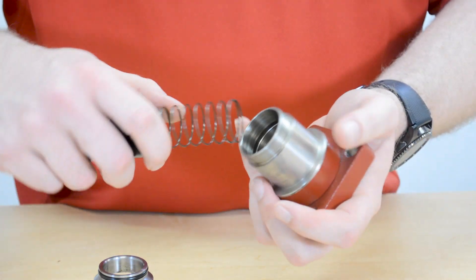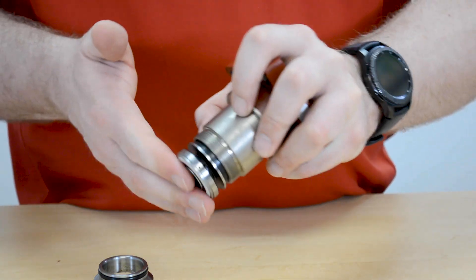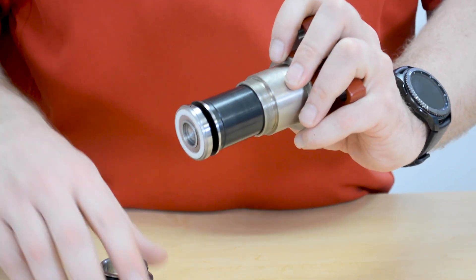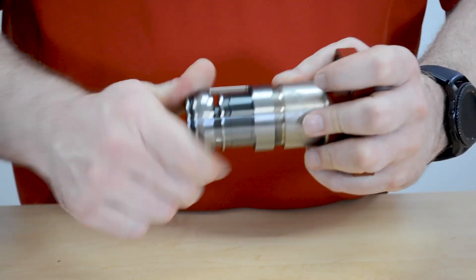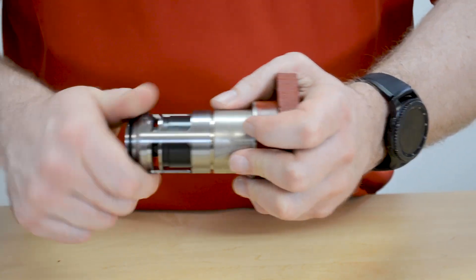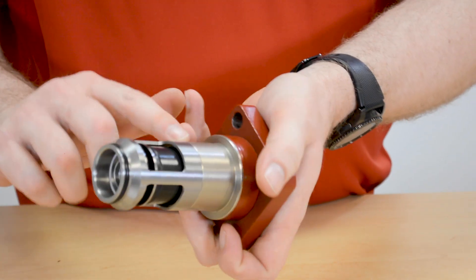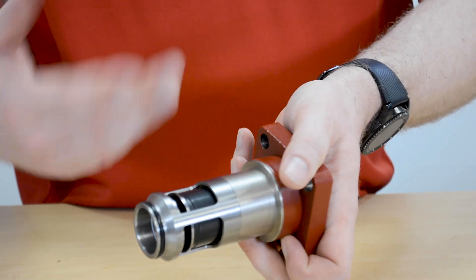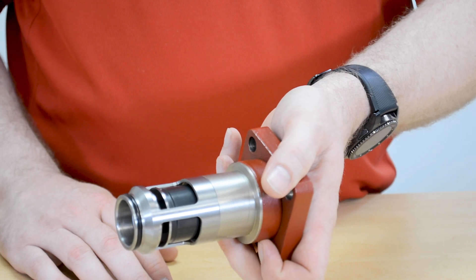Reassembling is very easy. Place the desired spring back into the cone, then place that back into the bonnet assembly and push it in. Make sure it's freely moving and that you can hear the siphoning of air in and out, confirming the passages and orifices are free. Once done, the cage assembly goes right back over the cone and screws back on. Ensure it's tightened completely where it interfaces with the rest of the bonnet, so you don't damage it when putting it back into the body and bolting on the four bolts.